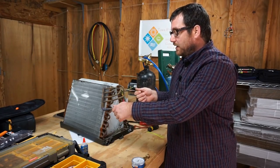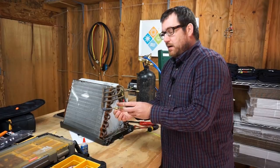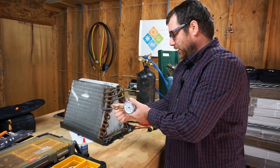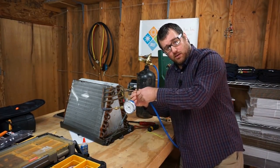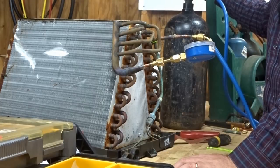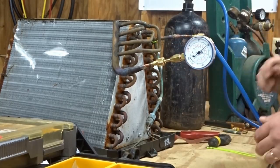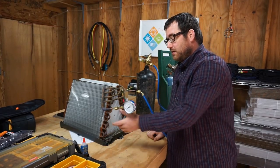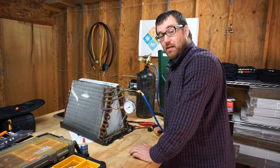What I'm going to do now is pressure check this fitting by screwing on my gauge here — just checking for egregious leaks in my joint, so you guys know I did my due diligence. All right, here we go — up to 50 PSI, then to 100. We'll stick with 100. No sounds. We're looking for bad leaks, looking for sounds. This looks like it's solid — I remembered how to braze. I'm glad that guy sent us these brazing rods because I was almost out. We're going to turn that off, let this pressure out, and then we can get down to pulling the vacuum.